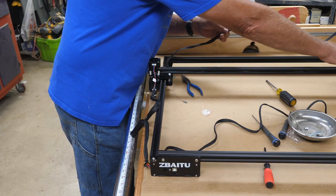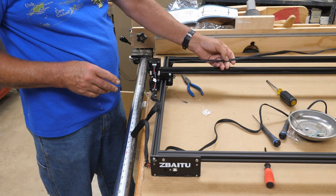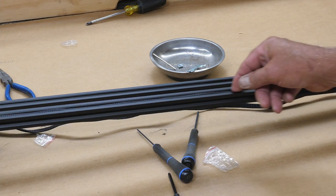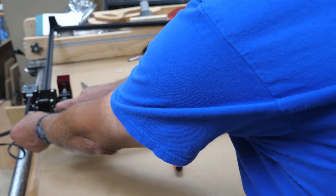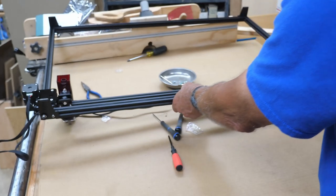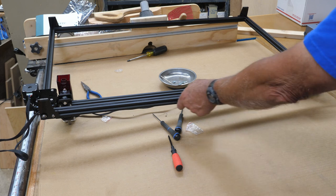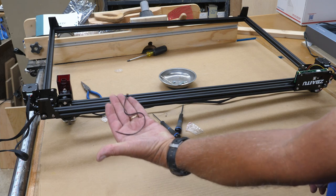Make sure you've got good travel all the way — everything looks good and works smooth. I may try to design a drag chain for that cable. I've got this upside down here to show routing the motherboard cable — it fits right down inside the channel and I'm going to make it stay there using a couple of zip ties. This will have to pass around the foot on this side so you have adequate travel over there. I'll still put a couple of zip ties on it to make sure.